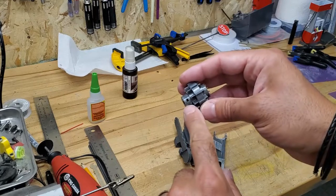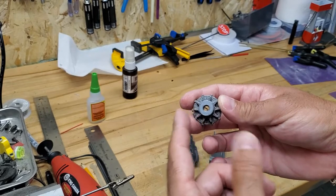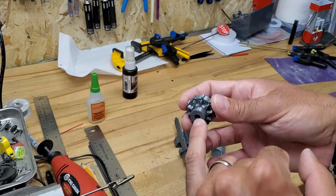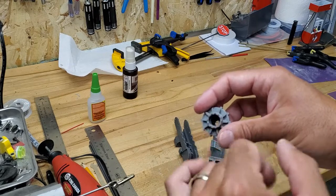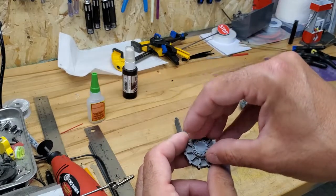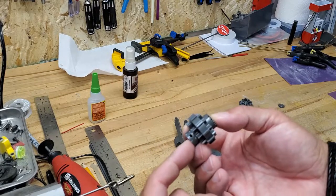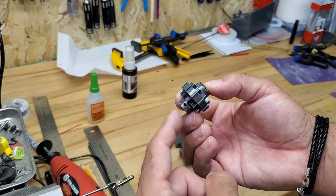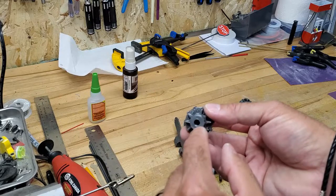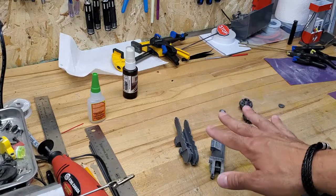As for the sprockets, they have a hole for a set screw and are designed for the motor shaft — I'll give you the specs, but basically it's a 100 RPM motor with a 6mm shaft. The set screw tightens down. There's a hollow section just so I didn't have to print a whole solid piece; then you put the cap on and glue it, because that's the last time you'll need to do that. If you need to remove the sprocket, just loosen the set screw and it comes right off.